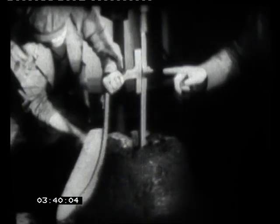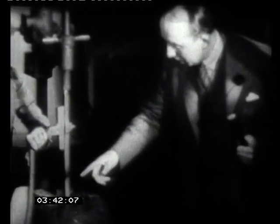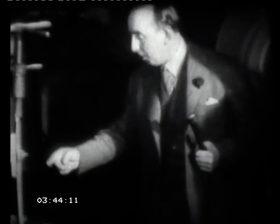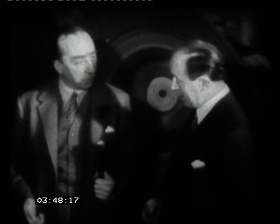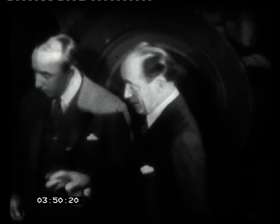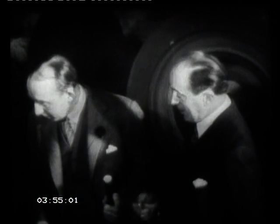Now, this is going to be the inside of the bell. This is the core, and this strickle is shaping it, and we would call it a strickle, but I don't think you do, do you, Paul? No, we call it a crook, after the shepherd's crook. Hundreds of years ago, it would look like a shepherd's crook, and bell founders call it a crook.